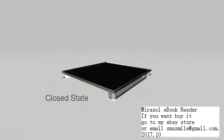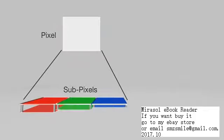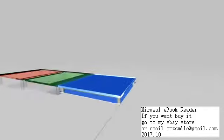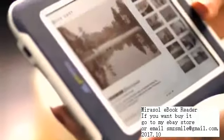These iMOD elements are miniscule — typically only 10 to 100 microns on a side. The color of the iMOD element is determined by the size of the gap between the plates. As shown, the red, green and blue iMOD elements have air gaps of differing sizes. By manipulating each pixel, a wide spectrum of color generation is possible. To create a flat panel display, a large array of iMOD elements are fabricated in the desired format and packaged. Strips of these elements are combined to form pixels, and pixels are combined to make the overall display.